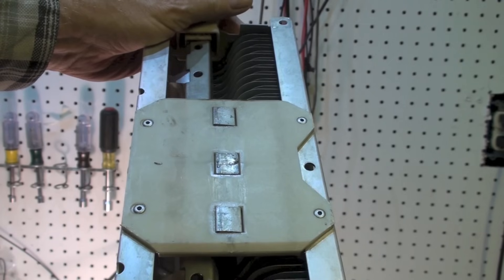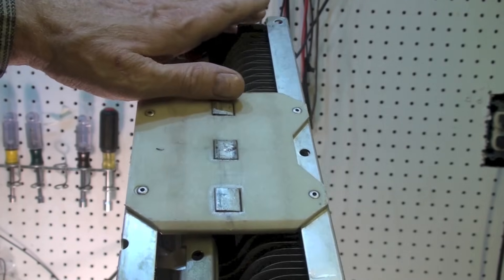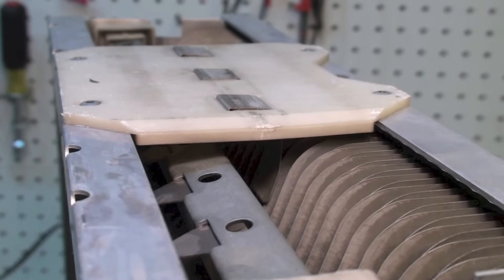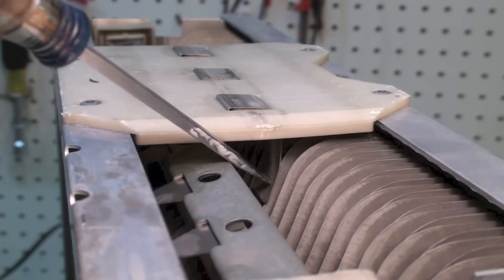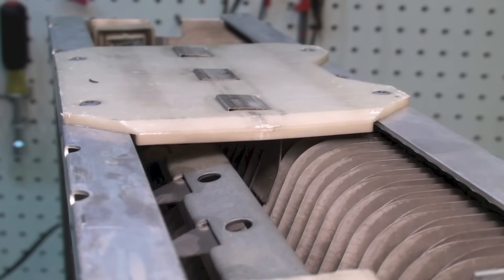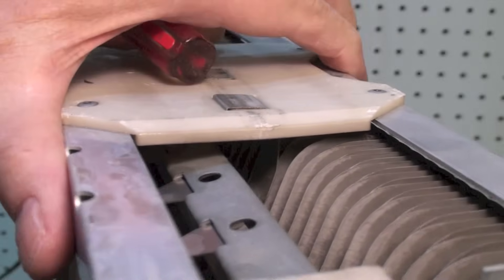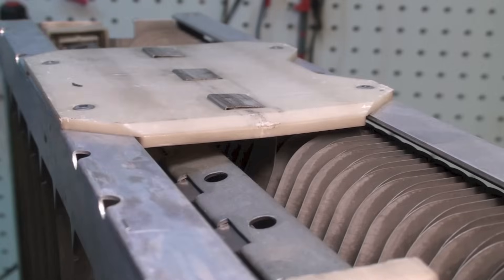The last thing to look at on these cells is the contact plate. These plates right here — we're not so much worried about this side, but I'll show you where they contact inside and what could be a problem. That plate right there should be resting on the top of these plates. If there's any corrosion in there, they'll be kind of dug down into this plate and it will corrode it out. If that happens, you can replace those parts — just put them on the opposite side.